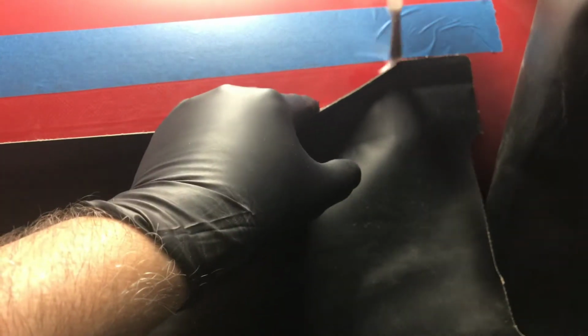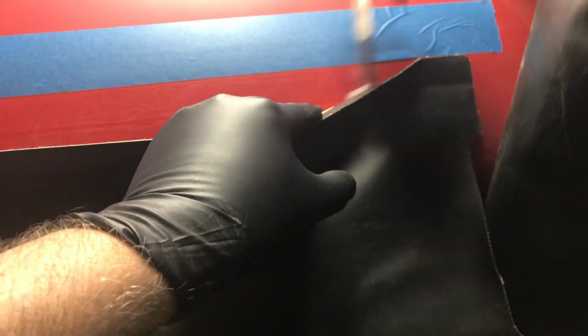There's a more graceful way to take the airbag out. There are 2 fill tubes on the transom, one for each bag on the left and right side, and you've got to unscrew the little hose clamps essentially that hold the tube up and connect it to the filler valve on top.